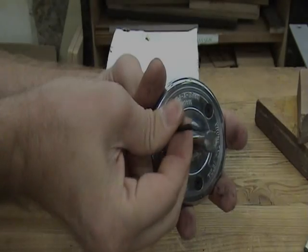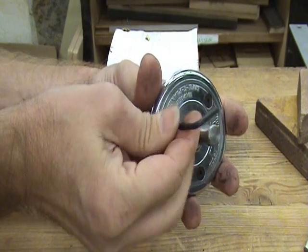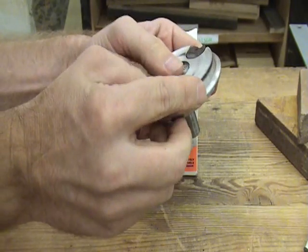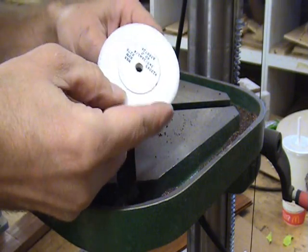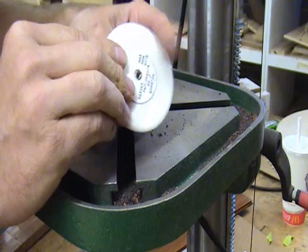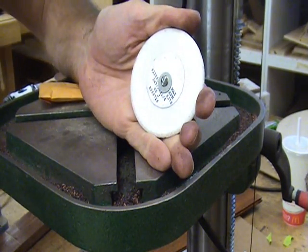I need to talk a little bit about how to sharpen the tool. Start by using the allen wrench provided with the tool to loosen the set screws that hold the cutter heads to the tool. Attach the grinding wheel to the shaft — this is also provided with the tool. Don't over tighten the screw that holds the grinding wheel to the shaft, and don't drop it as it easily breaks.